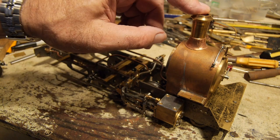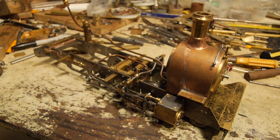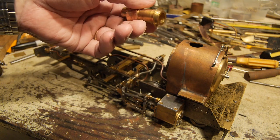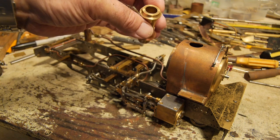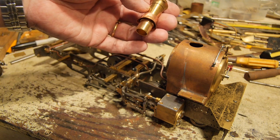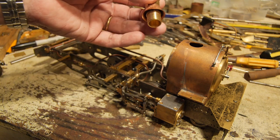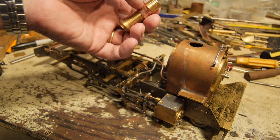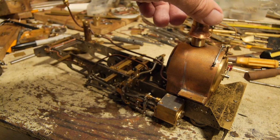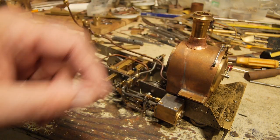Another thing that gives me the heebie-jeebies when I'm building a locomotive is this flared cowling which always goes over the chimney. The chimney was made from a piece of brass pipe connector that I bought at Home Depot, and that was machined on my lathe with a slight taper — it's to the drawings. But then I had to put this flare on it, and I made this flare out of copper. Pretty pleased with it — it fits nice and neatly on the smoke box top.